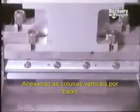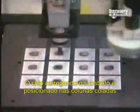The next step is to create the electrical connections that will later link the microprocessor to the computer's electronic card. They start with tiny cylindrical pieces of tin called columns. A giant suctioning sieve vibrates the columns until they fall through the holes, lining them up vertically so they can be attached to the substrate. A thick adhesive paste is spread that attaches the vertical columns from underneath.